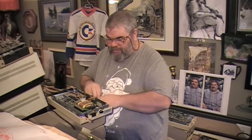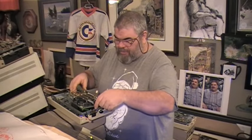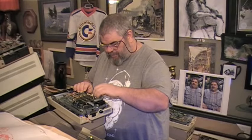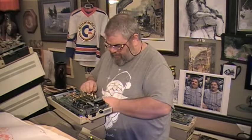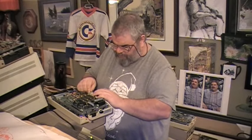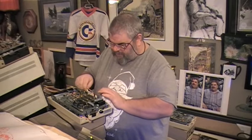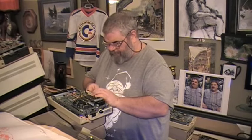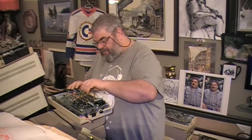That had one of the boards that was defective. If you were watching before, we had two different drives that would not spin. On one of them, all the chips were fine, but the drive still just spun. And another one, the 6502 chip, was defective. And then it spun. But then on another drive, where it appeared that one of the little chips by the 6522 chip had been replaced and was in a socket, when I pushed down on it, it fixed it.